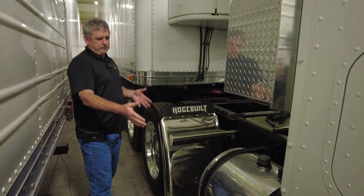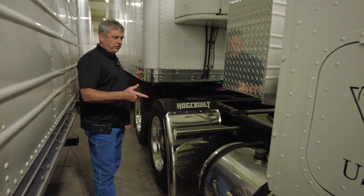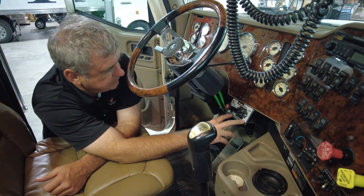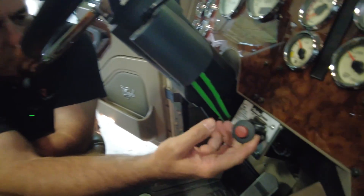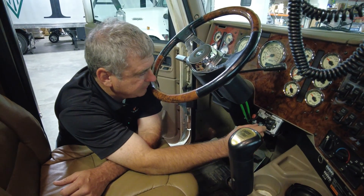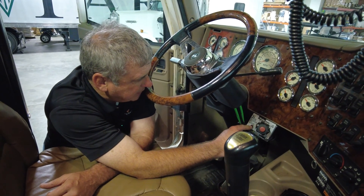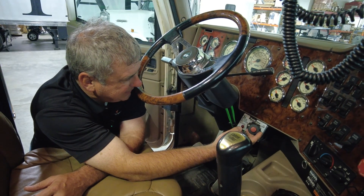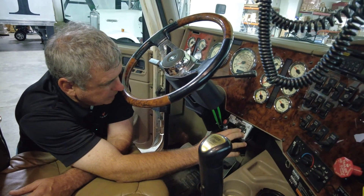In the old days, this is how it's done — and as you can see, it takes up the place of a step. It has to be another outboard tank, and it really doesn't look great. So this is how we started doing it, and now we're going to show you how we do it on our newer trucks. One of the things I mentioned is it is air shifted. This is what the air shifter looks like — this little guy moves here and sends a little bit of air. When you push the clutch in, it moves the gear into the rotating PTO gear off the main driveline. It contacts a little port and you get a light back up here to know that the PTO is engaged. Then you pull it up and take it out of gear.